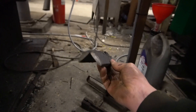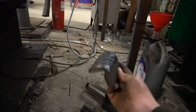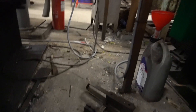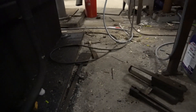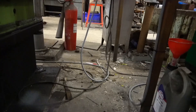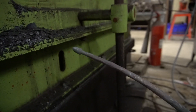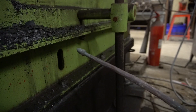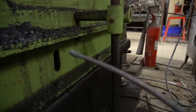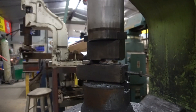Before the saddle block I was using bits and pieces like this — you'd end up clamping on the top, putting a G-clamp on the power hammer die trying to hold it in, but eventually the vibrations make the thing fall on the floor, which was a pain. This is my acorn swage — it forges these little acorns. You get a bit of 12mm round, shove it in there, give it a smash with the power hammer, and out pops your little acorn. Then you can extend the taper on a taper block. That little saddle block is absolutely brilliant.